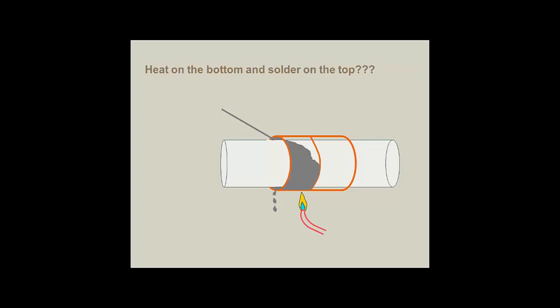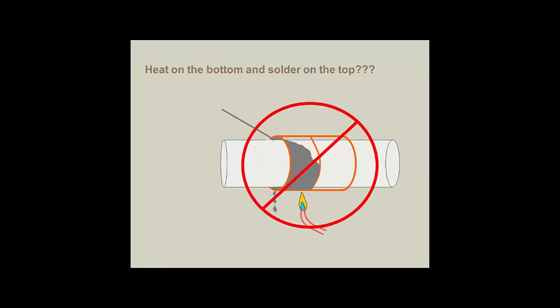One of the things that's very difficult for installers to understand is the only thing that causes that particular alloy to melt is its ability to absorb heat from the tube, the fitting, and capillary space. All of those components have to be at the temperature to melt the alloy to its full liquid state. So this particular process, which many of us have been using, probably is not the best way to go. Actually, it is probably one of the worst possible ways to make a solder joint, especially with the newer no-lead alloys.